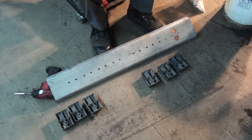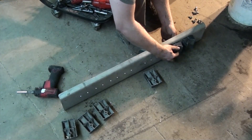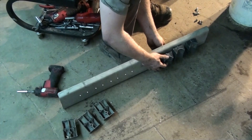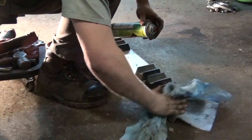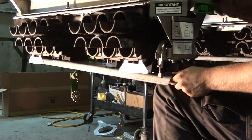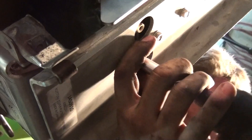Next we will assemble the bottom cover plate. The side with the two large holes will be opposite the chain drive. With it positioned as such, mount the plastic inserts with the raised protrusion facing the rear. These will line up with a notch in the manifolds. Do not tighten the screws yet — we want the inserts slightly loose so they will seat properly in the manifold. Now we can install OEM decals indicating the direction of airflow to avoid having anyone try to install it backwards in the future. Next, install the bottom cover plate and tighten the screws.